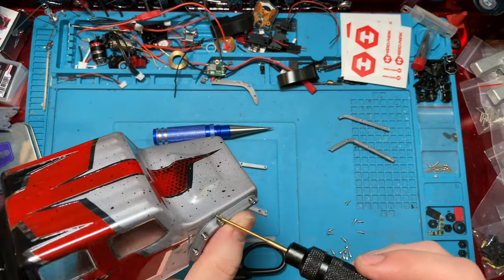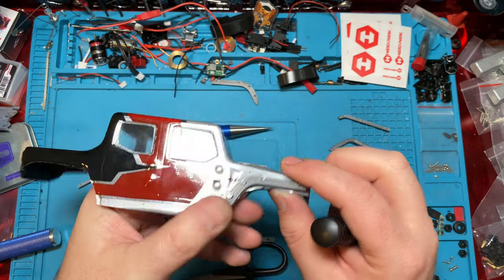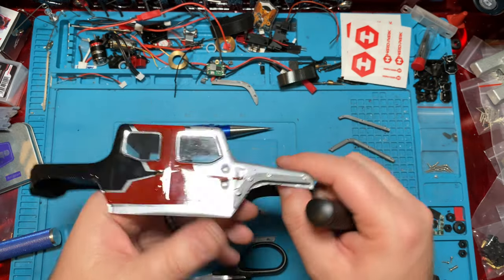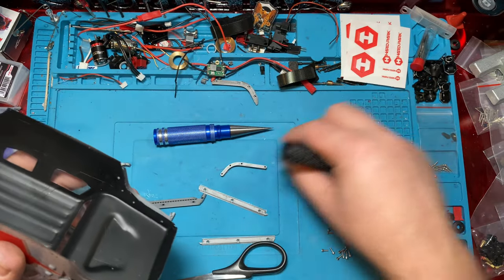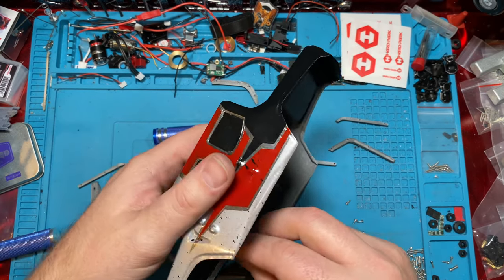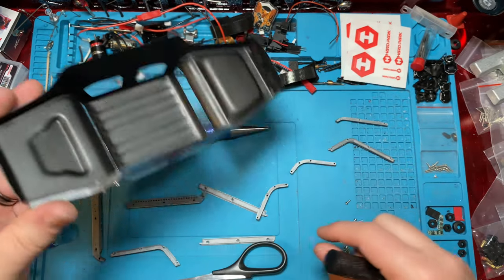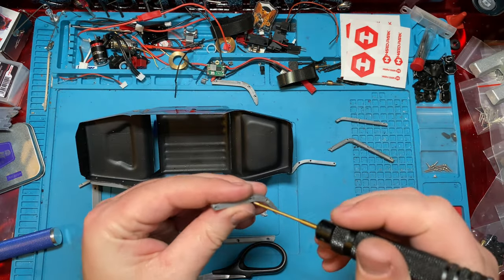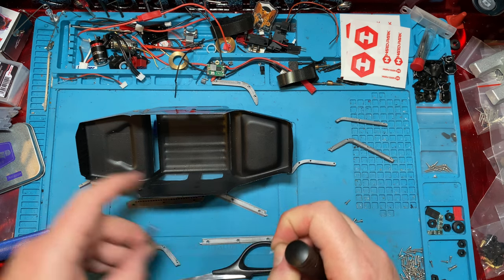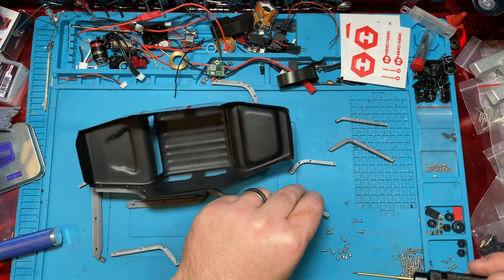Then go ahead and push and get your screw through. Okay, we still need to clean these up, like I said, but I just kind of want to get it on there. As long as it's flush, I'm good. Before we paint it, we'll sand them and do all that good stuff. For now, we're just going to do this, and then the back piece will go on, like so, and yeah, you're good to go. You might just need to do some starter holes on some of these if you find it too hard to get your screw in there. Don't try to do it through the body. Just pull it out, put a screw through, back it out. That way it's kind of threaded for you.